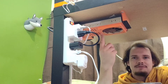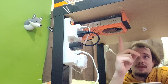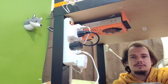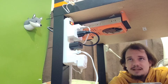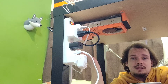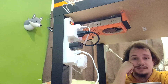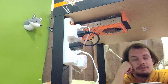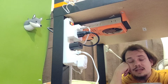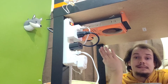I found a design on Thingiverse that replaces the original PSU cooling fan with a 92mm Noctua fan. It's quiet, so I can let this go while I'm sleeping. The only fan I hear is the one cooling the Titan hotend, and I've been thinking about replacing that with a Noctua too — though even if the CFM is the same, that doesn't necessarily mean it has the same static pressure.